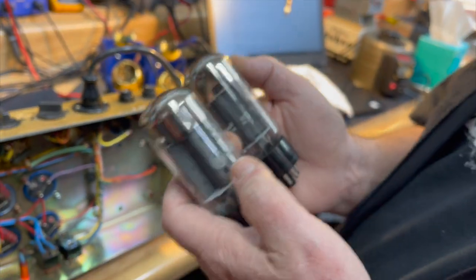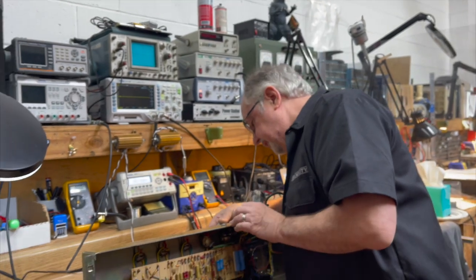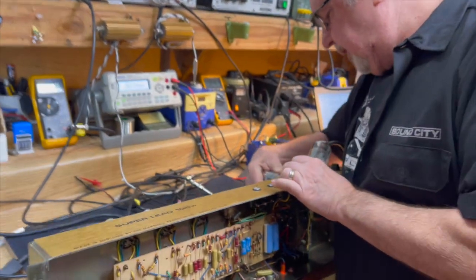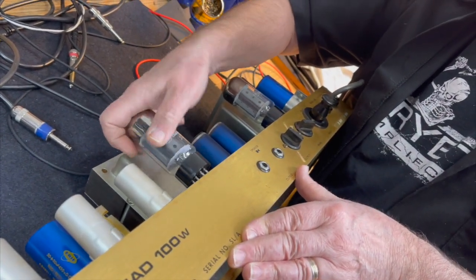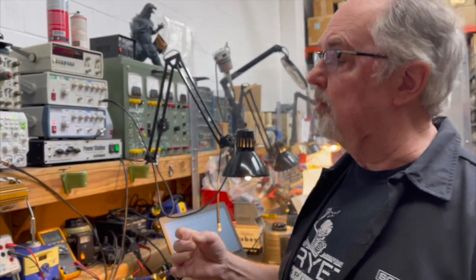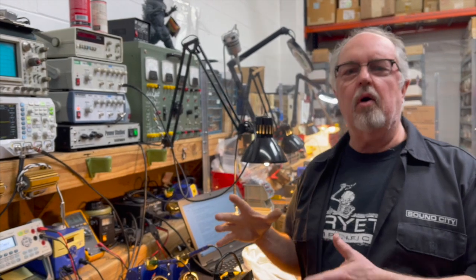This was GE's way of getting around the Mullard EL34 patent. Sneaky. They made them slightly differently so that they could get around the patent. Do you know what was different about them? Yeah, but it's pretty deep, and I don't want to get into it right now. But it has to do with the beam forming plates and how the suppressor grid is structured. They have the same basic specs, operate at the same basic impedance, have very similar characteristics, but they do sound distinctly different. They have more of a 6L6 sort of quality to them.